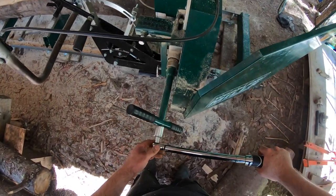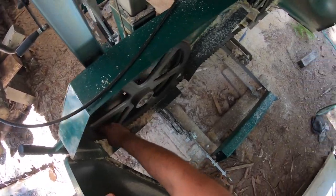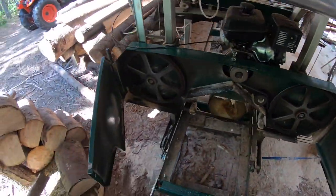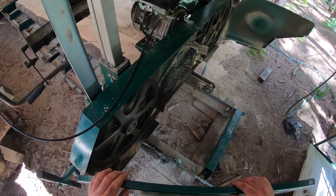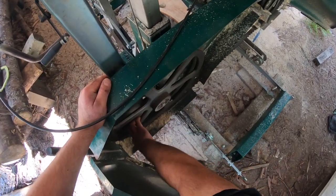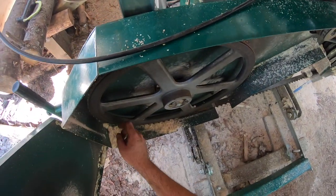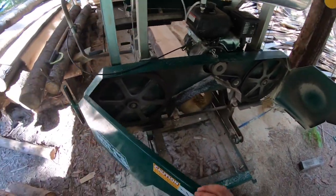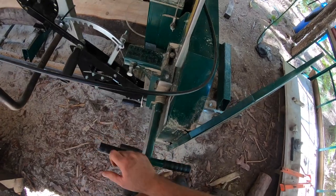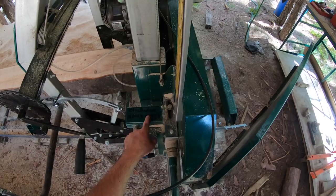Bringing it up to 25 foot-pounds — surprisingly I thought I was relatively close but I wasn't. Okay, there's my 25. I'm just gonna look again — it moved back a bit but I think we're close enough. So what I'm gonna do: I always stand behind this just in case the blade jumps off. A glove and long sleeve shirt would serve you well. I'm rotating it by hand because this is the kind of thing that can happen — the blade has moved all the way back. Look at those teeth, they're all the way back; that would jump off if I'd started the engine.